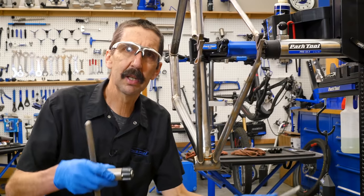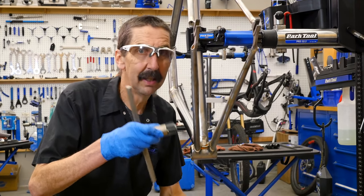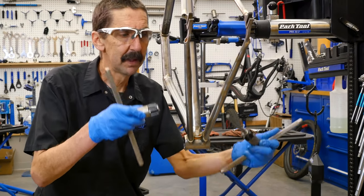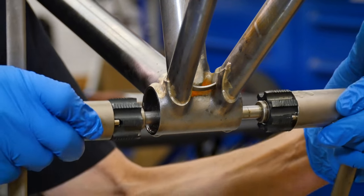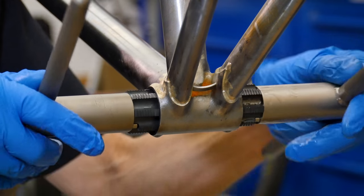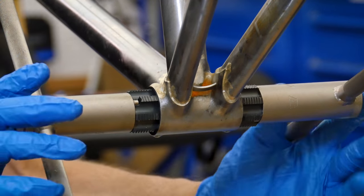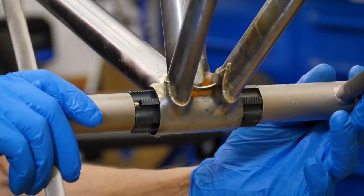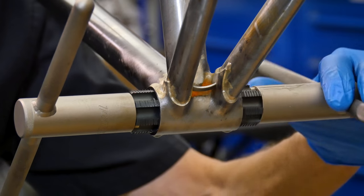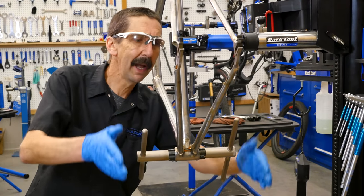It's important to start together. One tap alone trying to start — it's easy to cross thread and damage that important first thread. Together, with the arbor, they both go in together. It guides each other. So here the right side is turning right. We can feel it catch that first thread. This side is turning left. It is mirror image to the back.